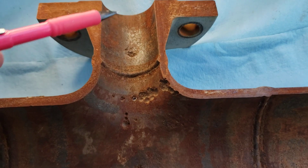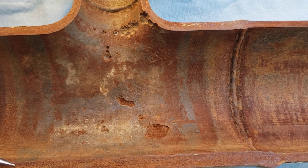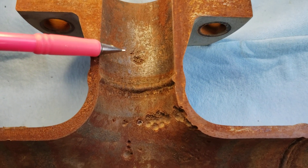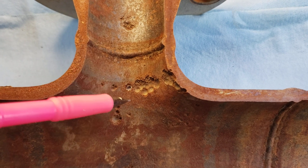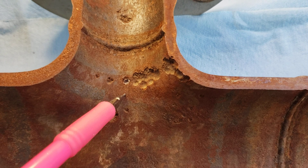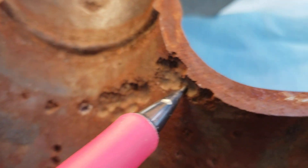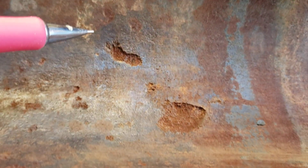What we're seeing is the 2-inch branch on the 4-inch piping. This is the 4x2 T, and you notice that there's corrosion in the 2-inch neck and then downstream of the weld. Right as the neck of the T starts, you have pitting — maybe cavitation, maybe both — in the body of the T.